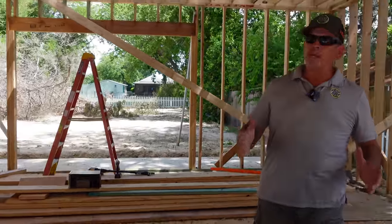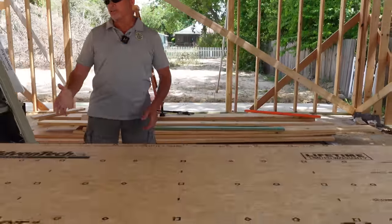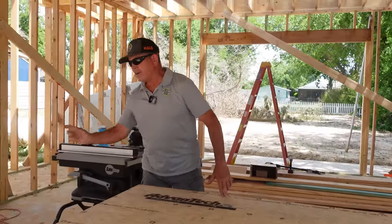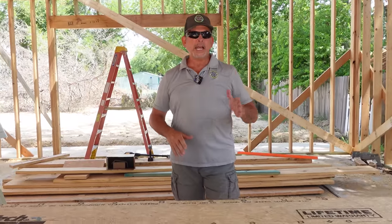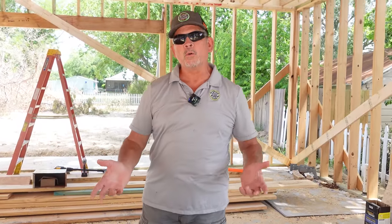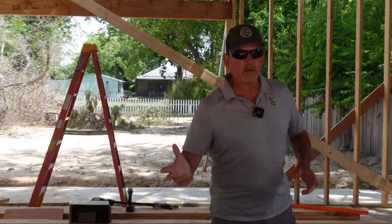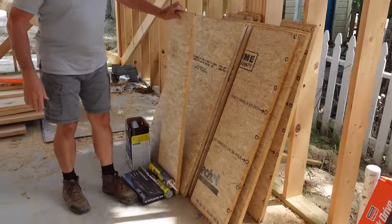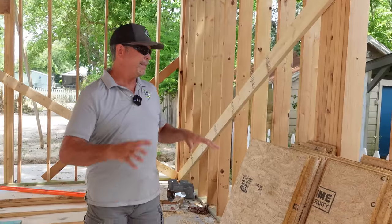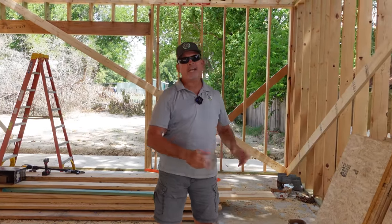We're only 90% complete for two reasons. First, our garage is an inconvenient 24 feet 2 inches wide, and these sheets come 8 feet long — so three sheets gives 24 feet with a 2-inch strip left over. We cut a starter course, just like laying tile or wood flooring, so you don't end up with a sliver. We have some pieces about 11 inches wide and some about 30 inches wide in our scrap pile, but that material is not going to waste — it's perfect for all our stair treads.